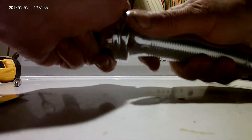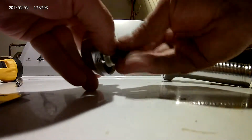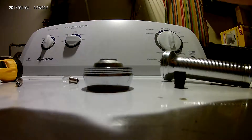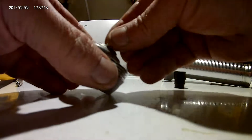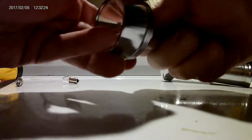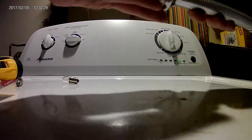Let me put down my camera and show you real quick how to do this. Unscrew the flashlight housing here on the end. There's your bulb, and you're going to unscrew this — it's just a little pressure fitting. Pull out the old key bulb, there it is. Open up the little conversion kit, install it, it just drops in. Put this back together, nice and tight, and we'll fire this up together for the first time and see how good this conversion worked.